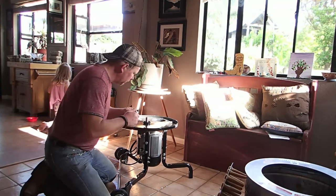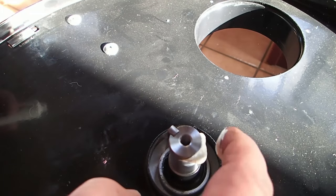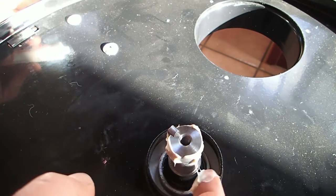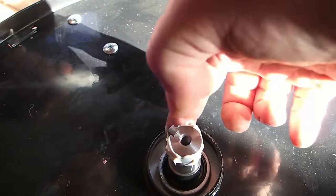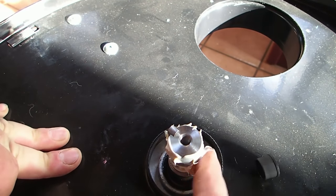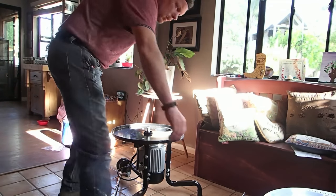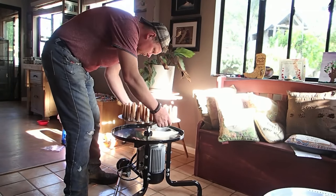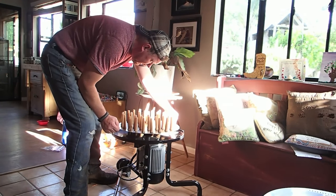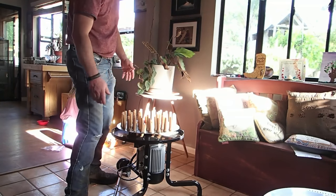I'm going to put just a little dot of grease on my finger and spread it all the way around that shaft. Then we take our feather plate, line the keyhole up, and set it right down on there. It does have a little play — probably a good 30 to 40 thousandths — which is going to lead to vibration, which is going to lead to wear, hence the grease.